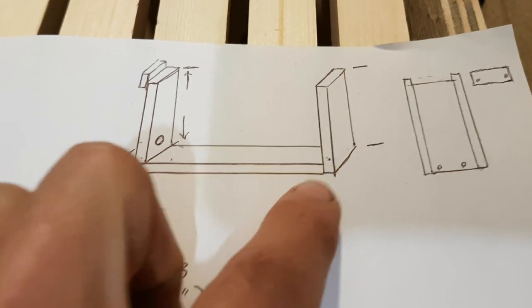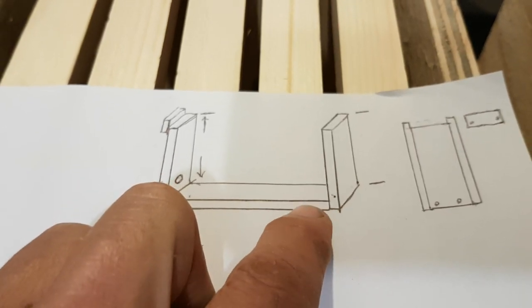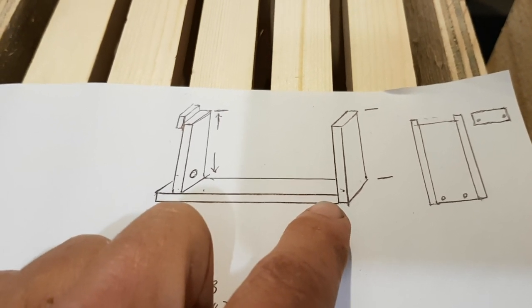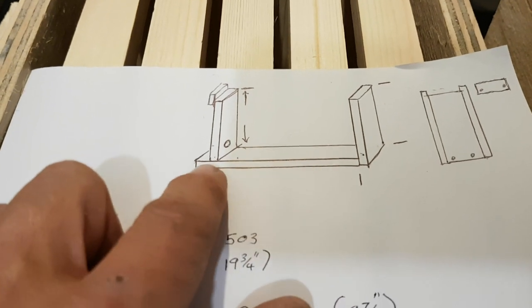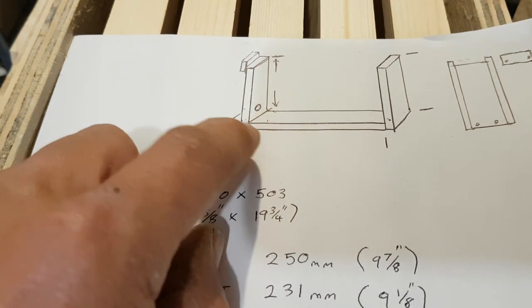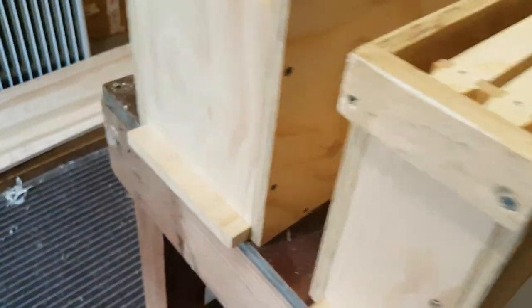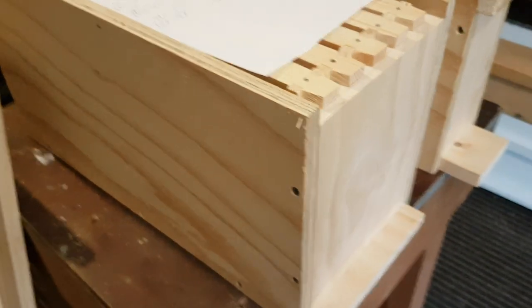Here's the diagram. You want to screw the back — it's the longer of the two short pieces — into the base with a couple of screws. You can glue and nail, that's fine; I'm just using screws because it's easier. I didn't even glue these ones and they're as strong as an ox. Once that's together, measure out your 503 — that's your ply size — mark it, and that'll be the outside of this piece. Screw up through the base to attach it, then fold it down and put on your ply side and screw it up — and that's it.